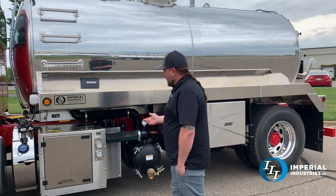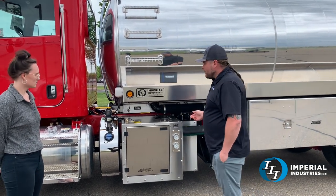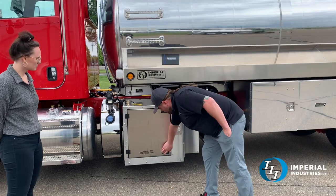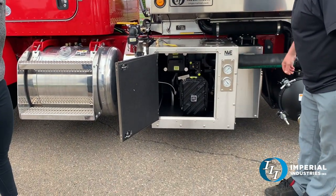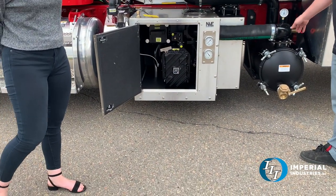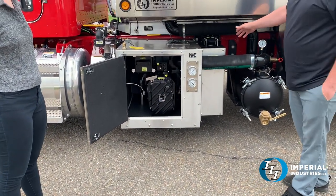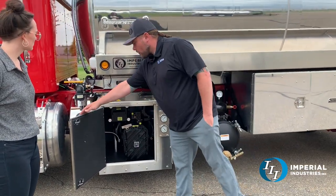On this one we did the NV4307 blower, 560 CFM — a neat little package you've probably seen in our videos. Everything's nice and enclosed in a stainless steel cabinet. There's a stainless steel 14-gallon secondary here and the silencer right here, so everything's on the same side of the truck, nice and neat with the air lines, nothing going back and forth.